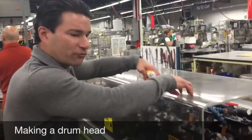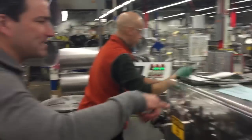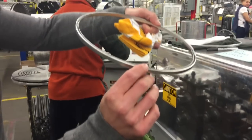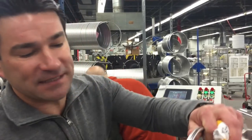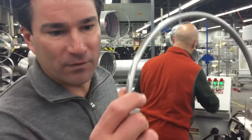Yeah, so the flat aluminum gets pulled gradually through this cold-form process and actually gets shaped as a final hoop. It has an actual profile built into it that's designed to lock the film into the hoop so it can hold a tremendous amount of tension. And this opening will eventually get soldered together for reinforcing strength.